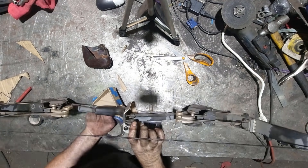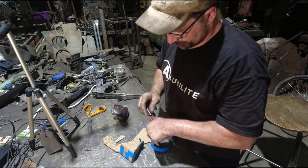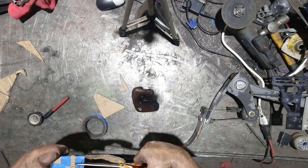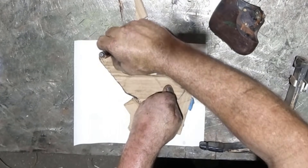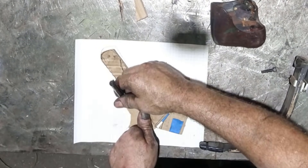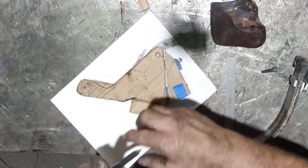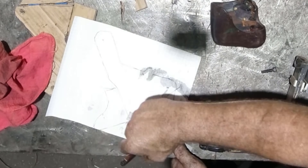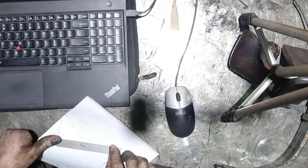A little bit more refinement — I go and figure out the angle and profile of where the socket fits into it, make sure everything is good, and figure out that I can add about an inch and an eighth more to that profile. Next, I go to a piece of grid paper and rough it out. I align the long axis with the grid and do a little offset to where things are really going to be, then just do straight lines. Whenever you're converting something onto grid paper, rather than cutting all your radii to make it pretty, it's better to just do straight intersecting lines so that in CAD you can have real hard points.